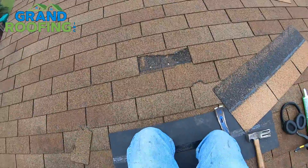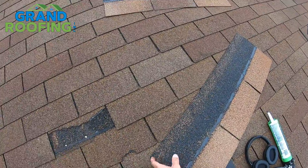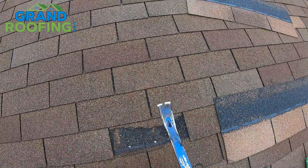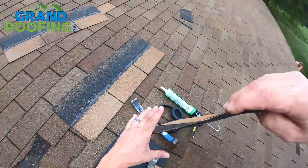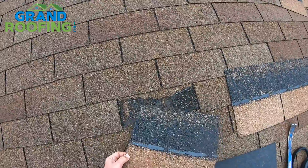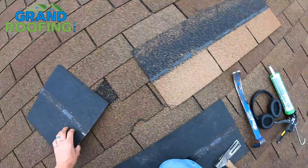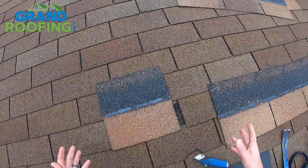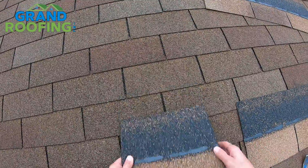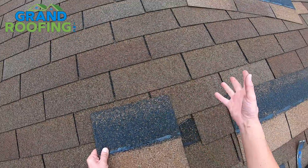Let's get started. Just a little bit about the terminology of the shingle and how to do the repair. What I've seen people do — let's cut one of these down so I can show you — they'll just try to shove this under there, but the problem is it's going to hit nails everywhere. So they cut it short and literally slice it right here, just kind of tuck it up under there. It's not a good repair. Or say this tab is completely missing — they might cut it short just to tuck under and not hit the nail. But the problem is where it's missing, since they've cut it short, it'll trickle in right there.